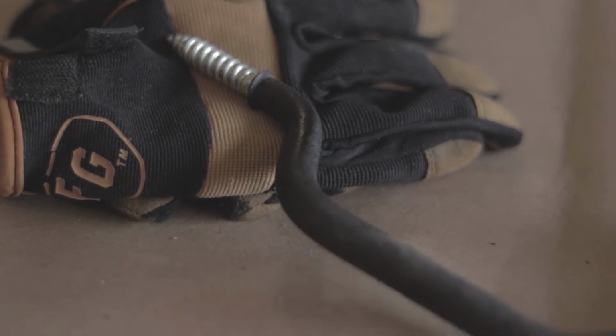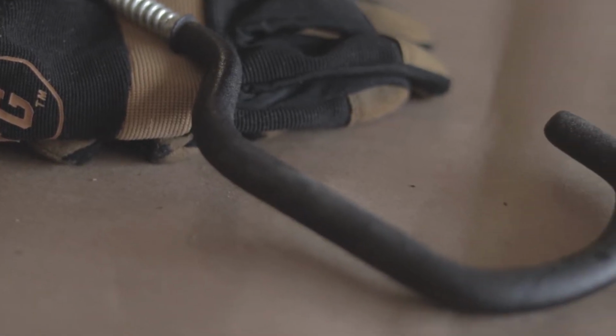So after you've got your 2x4 good and secure on the wall, what you're gonna wanna do is start putting in your bike hooks. It's the big rubber coated type bike hooks. So you're gonna wanna pre-drill before you start screwing those into the 2x4. I mean, it is a pointed coarse thread. You could probably screw that right into the 2x4, but what's gonna happen is if you do that, you're gonna split that stud out horribly.